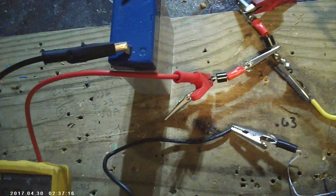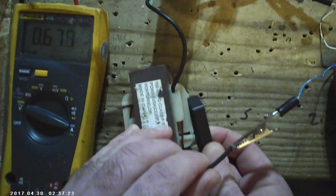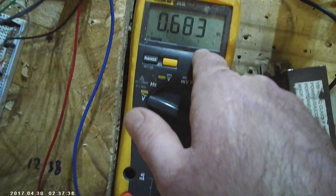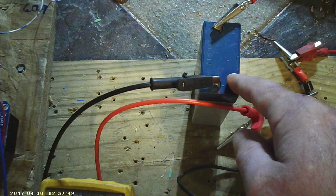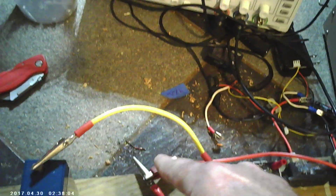Here's a magnet that sticks on that — we've got a nice huge magnetic field coming out of here. Remember, this is only the leakage because it's all enclosed by that choke. This thing has a ton of amperage in it. The voltage raises well enough to send good amperage — not inductive flyback amperage, not like one millivolt — we're doing 683 milliamps into the battery. That's not inductive kickback, no matter what anybody says. That's coming from the positive coming back out, and all we've got going into the circuit is five volts in. That's my presentation.